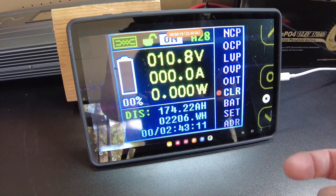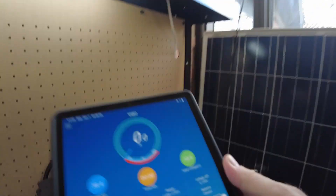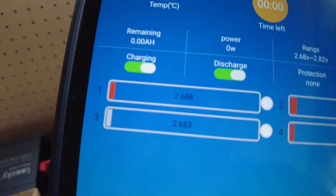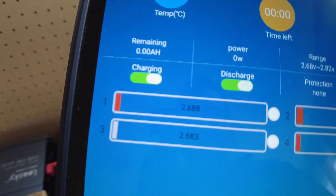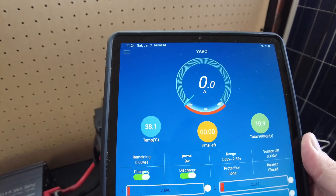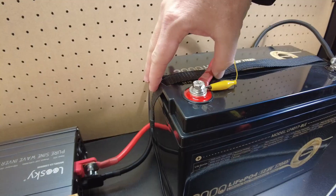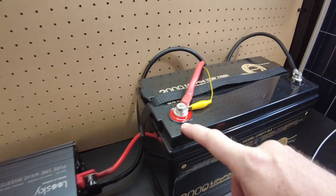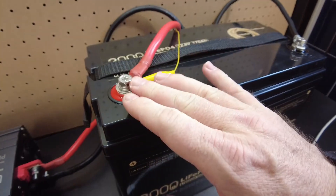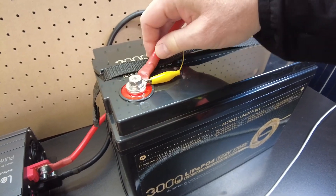This thing has pulled full capacity, so that's really great. Let's take a look at what the BMS is showing. The BMS shows zero amp hours remaining. The cells are at 2.6, 2.6, 2.8, and 2.7 — so not too far off. Temperature shows 31.8°C. I'm going to charge this back up and use a different cable with a load, to see if it's still heating up. Because it could be this cable — I have had a problem with this cable getting pretty warm.